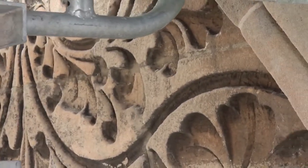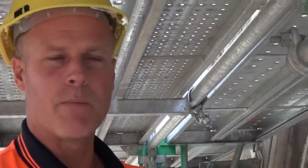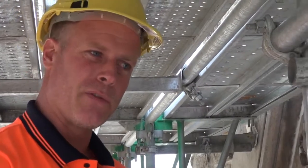Back in, I believe it was the late 80s, early 90s, the building had some renovations done on it and they used a cement mortar. The cement mortar is actually what makes the stone fail. So if there's any movement, the joints are meant to fail and not the stone. When you've got cement in between the joints, the stone fails and not the mortar.